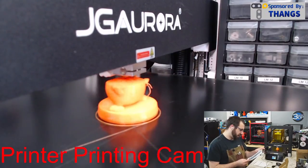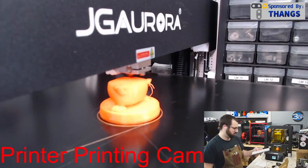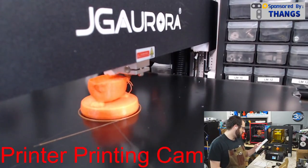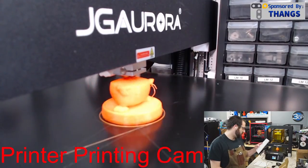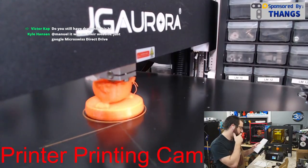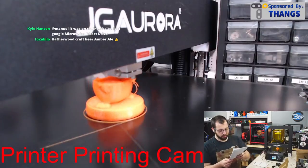Do not leave the operating printer unattended for too long. A 1 to 3 hour interval is necessary if the printer runs over 96 consecutive hours. What does that even mean? Like, if you're printing for 96 hours, it's okay to leave it for 1 to 3 hours? Do not keep nozzle or hotbed always operating at high temperatures if you are not printing. Okay. At least 5 second on-off interval to prevent printer from crashing. Risk of trapped fingers. Keep your clothing and all parts of your body away from printer moving parts. Okay. Turn off printer immediately when there is smoke or unusual noise when printing.